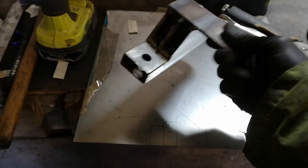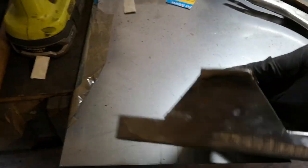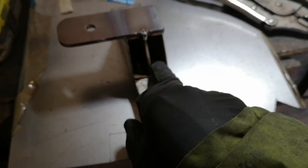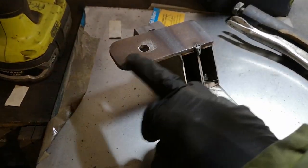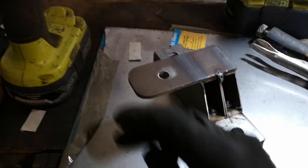So while the primer's drying on that, this mount needs some sort of finishing. What we're going to do is close the panels — I've just welded along the top edge, welded the seam, the top edge, the underside and the seam there. Now we're going to plug weld it inside. Before we close it off inside, we're going to cut some tube which will fit inside there, so that when you put your bolt through and do it up, you don't crush the tube — you actually squeeze it down onto the gearbox. Then we'll see if this little section here doesn't need a reinforcement. If it does, we'll just put a little upright bit on both sides — that won't be an issue.